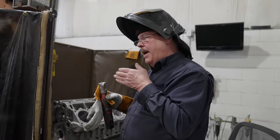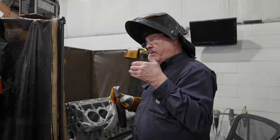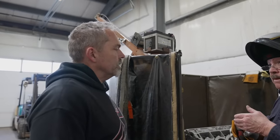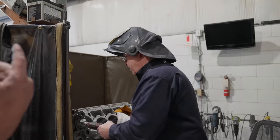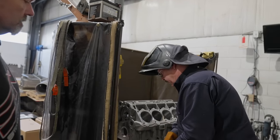Grinding the lines parallel to the center line affects the flow of the electrons too, and the arc start. Yeah, that one I knew. A lot of guys grind it circular, but you can't do that, because the arc goes all over the place. Correct, until it balls up, but then you're okay. Huh. Actual degree matters.